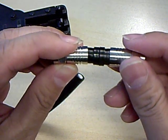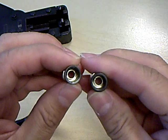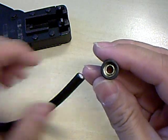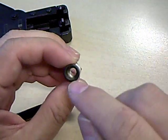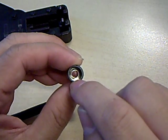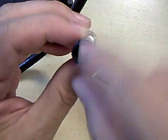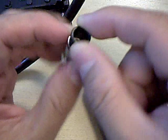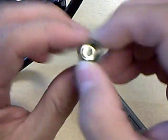You can see there's a slight difference between the size of the gap between the inner sleeve and the outer sleeve. The quad shielded one has a larger outer diameter to fit over the quad shielded cable and give more room for the layers of shielding to fit between and form the compression when you insert it. It's the space between that center sleeve and this plastic sleeving that creates the compression that holds the connector in place.